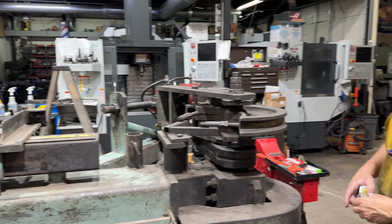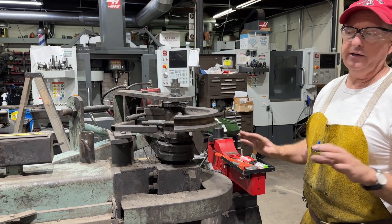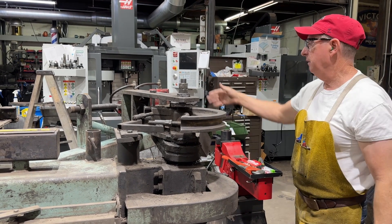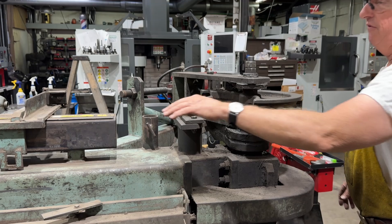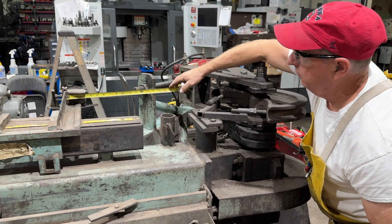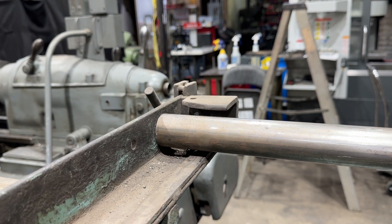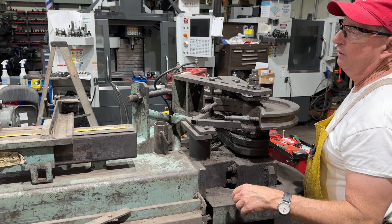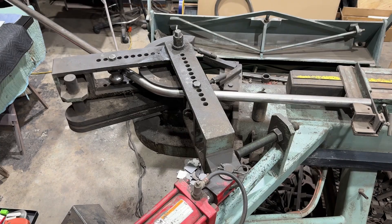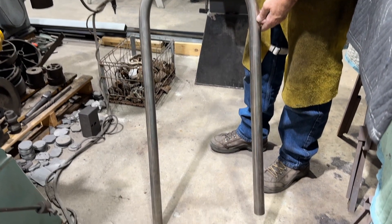So we can dial it in and do repeatable bends. It operates very quickly and it's pretty easy to use. It doesn't have any electronics or anything like that — it basically has controls to control the movement of the cylinders front and back and the closing and opening of the cylinder. We have a stop here with a tape measure on it, so when you bend, you essentially rest the tube or pipe against this portion right here — this keeps it from moving. Activate the air cylinder to hold it, then initiate the bend sequence depending on what you're bending. We mostly did 90 degrees and 180 degree bends, but it was designed for production work, and we have done tens of thousands of bends with this machine, and it's still going great.